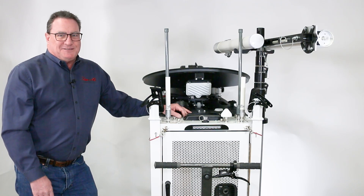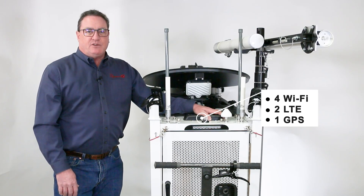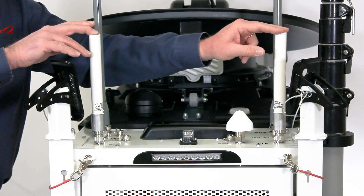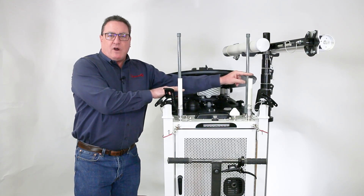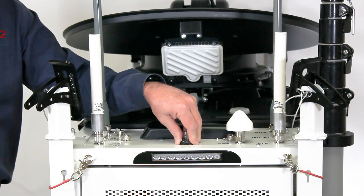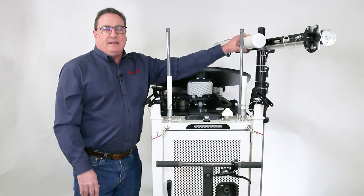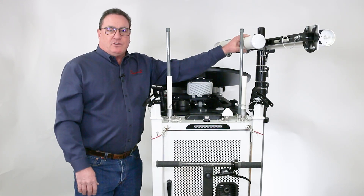This section is called the antenna deck. There are 12 antennas on this deck. The brick carries seven antennas — four Wi-Fi, two LTE, and one GPS unit used for the CradlePoint. This is the GPS unit used to feed the cell radio. The two large white antennas are LTE backhaul antennas used by the CradlePoint router to reach back to a cell tower for internet connectivity. The large gray antennas put out a large Wi-Fi bubble to almost a thousand feet. This strobe light is used for the alarm system — not only will you get an audible alarm and a Bluetooth notification, but also a visual strobe alarm telling you there's a problem. On the mast are the two high-gain LTE antennas connected to the FirstNet cellular radio, providing approximately a two-mile bubble of true FirstNet Band 14 cell service.